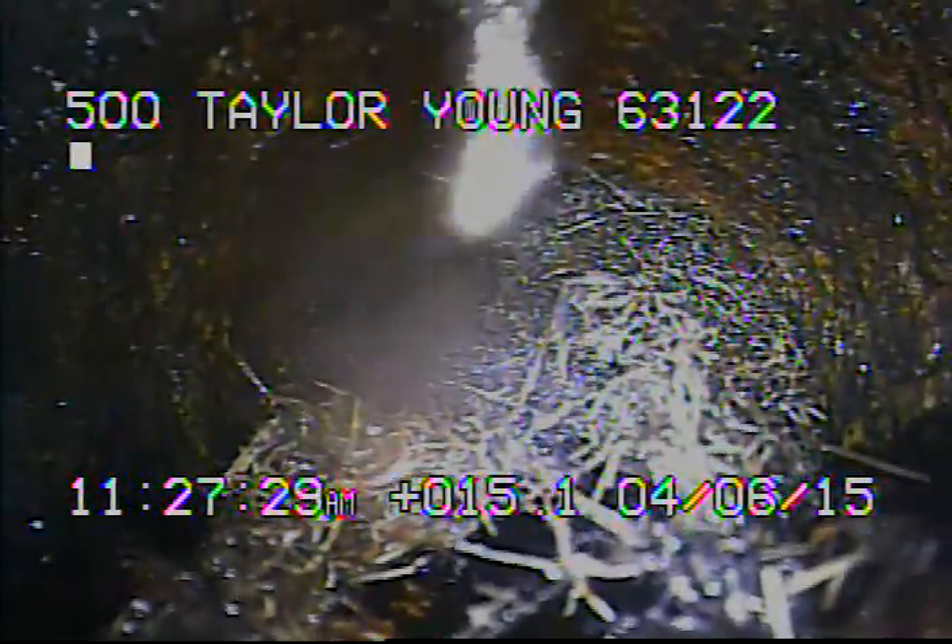Because of the amount of roots that are in this cast iron, I'm going to recommend that the cast iron be replaced. Right here we're coming up the vent stack.